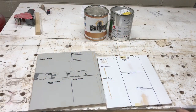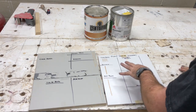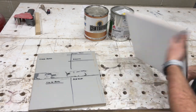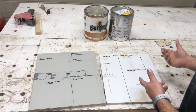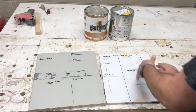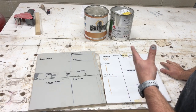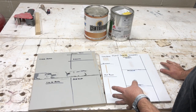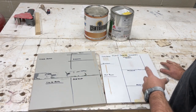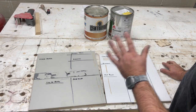So what we're looking at today is the Centurion 275 and the Exalta. This was from the previous test that I did on an unsanded surface. We're going to look at a crosshatch, the kind of mar resistance, and then our lacquer thinner, denatured alcohol, and acetone. What I want to see is if lowering the VOCs and HAPS actually makes a difference. There's a lot of guys out there that say all this stuff isn't what it used to be, which is probably true, but I also want to see if some of these companies have adjusted for that.